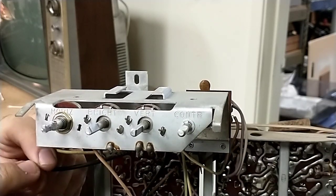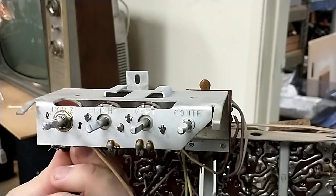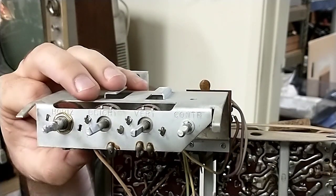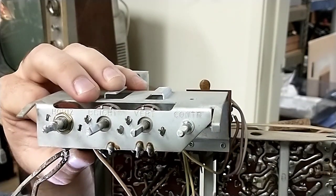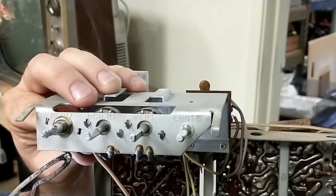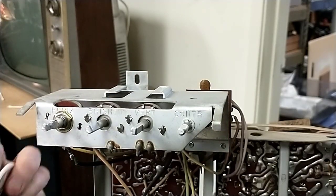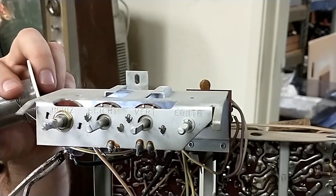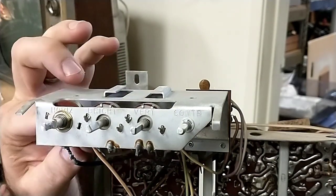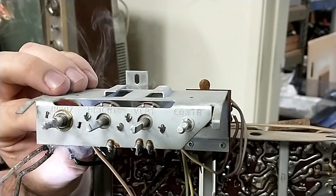And I'm just going to make a little hook with the resistor so that it hooks down and goes into the hole on the potentiometer, because again, it's good to have a nice strong mechanical connection. I'll even fold it over with the soldering gun. And then we'll finalize the solder, and then we'll do the same with this one.